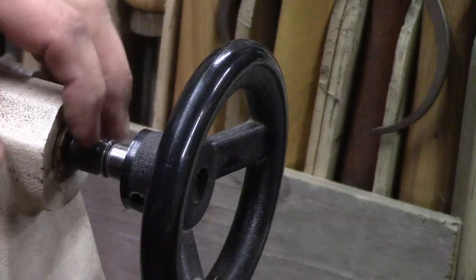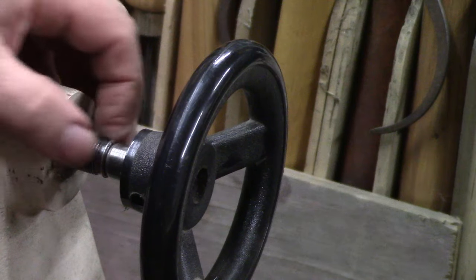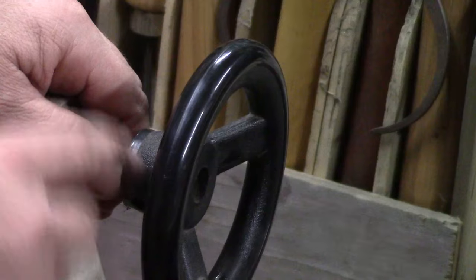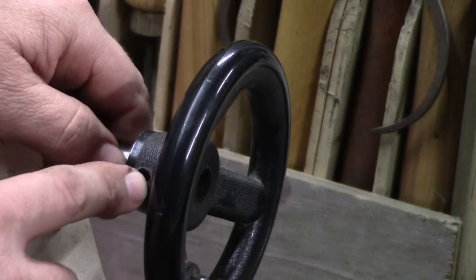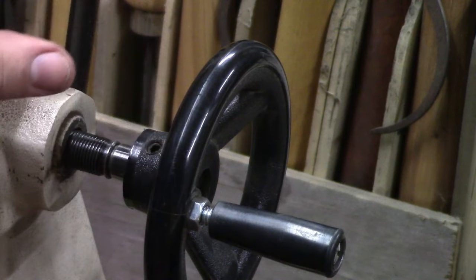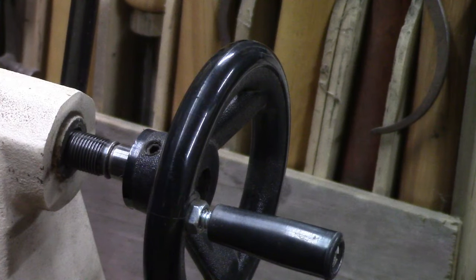It's a little half moon shaped clip with little knobs on the inside curve of it, and it grabs on here. Now the trick is you're supposed to unscrew this the entire way out this way, and then we'll put the E-clip on and stick it through, and we'll have to take this handle off. This handle part, the round part here, will come off. It comes off with Allen screws, I'm pretty sure, and we'll take that off and put our new E-clip on and have to thread it all back through.